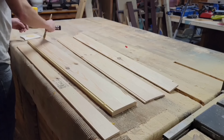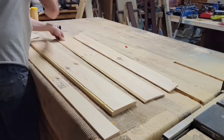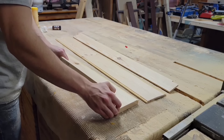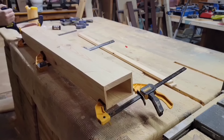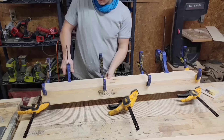In case you're lost as to what my plan is: I'm going to glue up these four sides into a beam and then cut that beam into slices to make each of the 20 boxes. So anything I do to the beam is what the final drawers are going to look like. All the sides of this beam are a quarter inch, except for the front face which is three-quarter inch — I did that for a reason you'll see later, but it also makes the beam and the future drawers look bulky. So to make the drawers look a little nicer, I'm going to cut a cove in that front face.